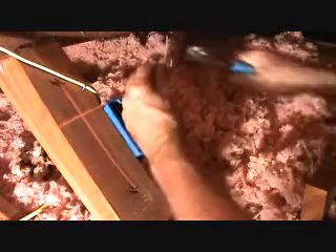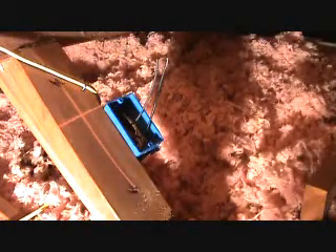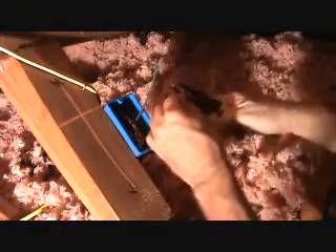It's working, we're live. I'm going to take that off — that's an old wire nut. I'll use a new wire nut and go ahead and cut these a little bit. You don't want them too long or it's hard to push them all back up in the box. Okay, here's that old wire again — takes a little bit of doing but I can get it.